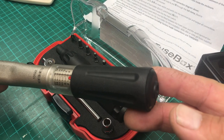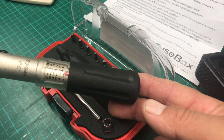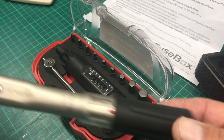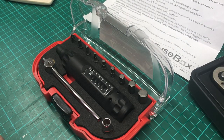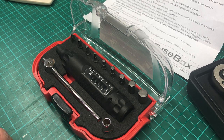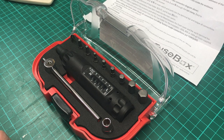As you can see, although this torque wrench goes up to 22, put it in focus — the scale is quite coarse, there's not much of a gap between two and four, and the spec sheet was asking for 2.5 Nm on some screws and 4 Nm on others. So you do the normal thing and go on YouTube, Amazon, eBay, and Google 'torque screwdriver'.